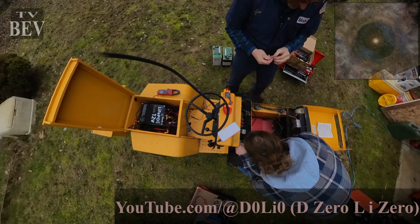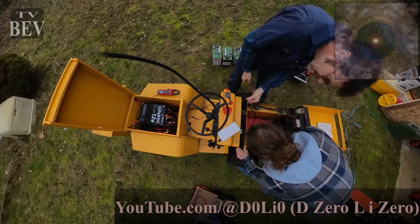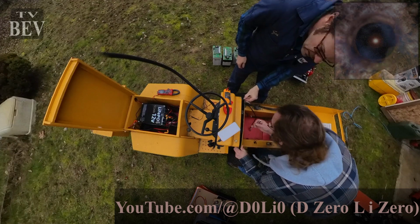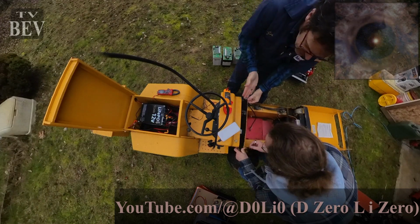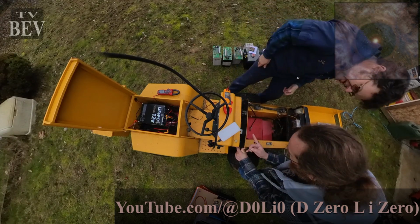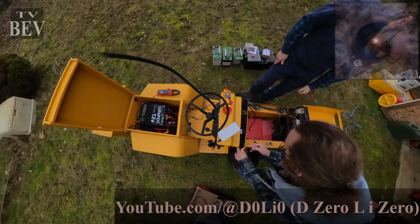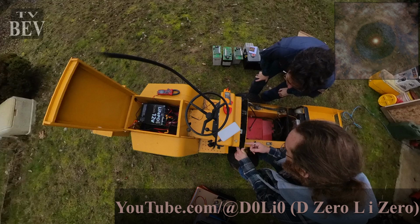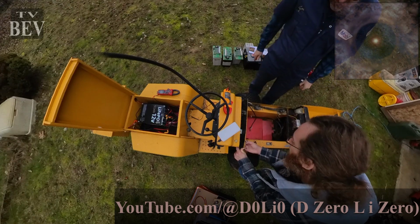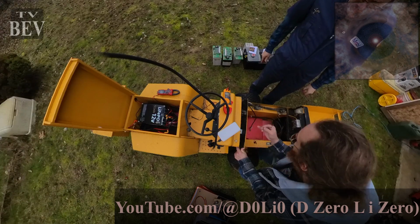Go in one corner. Yeah, it's just a big Phillips. Clearance on that board is not super great. Maybe we could put some washers underneath it. Could let it stand out a little bit. The bracket could also be bent a little bit that direction. Well, I think it's bent this way because the clearance between the board and the L bracket is such that the board is making contact with the mounting surface. So a couple washers underneath the screw, underneath the L bracket, would give it clearance.